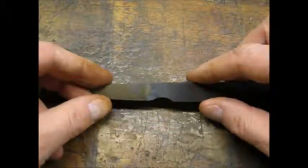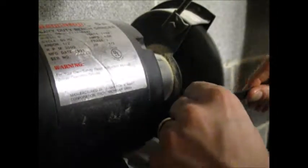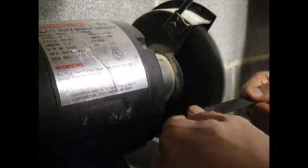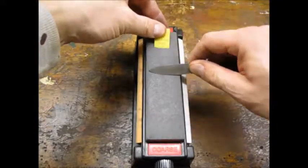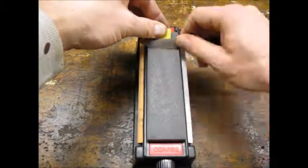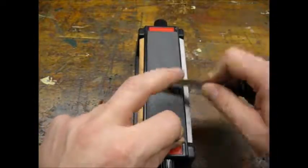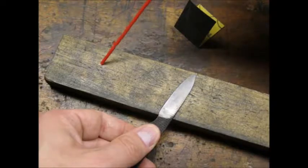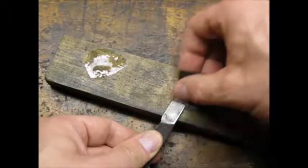The blade had a golden straw color after tempering. I cleaned up the blade and handle with a wire wheel. I used my coarse sharpening stone to form the edge — this process took some time, as I had left the edge pretty thick to avoid any cracking when I quenched the blade.